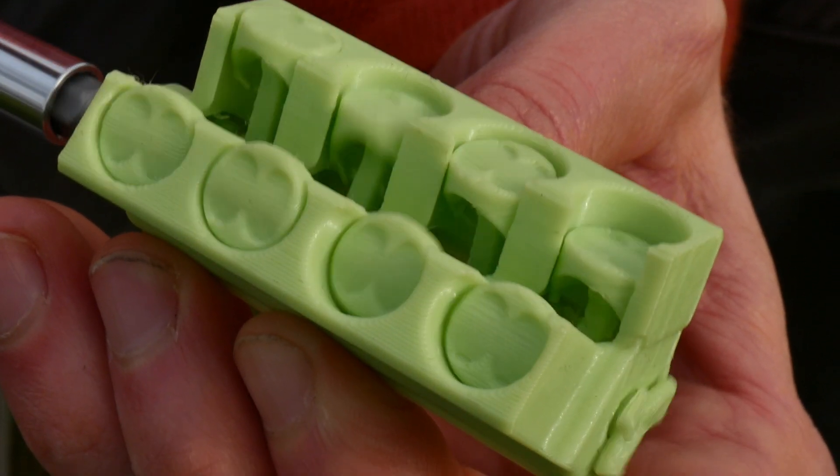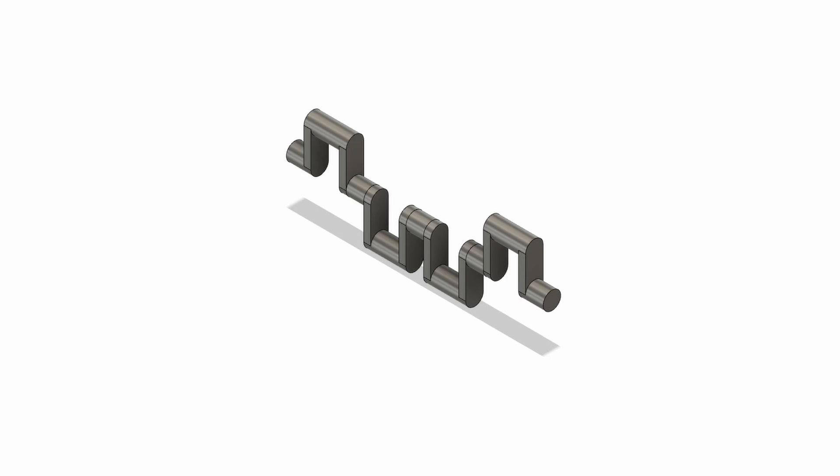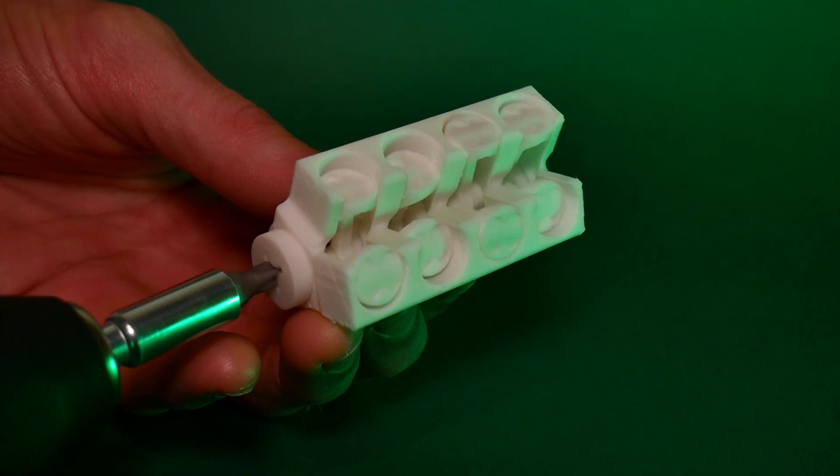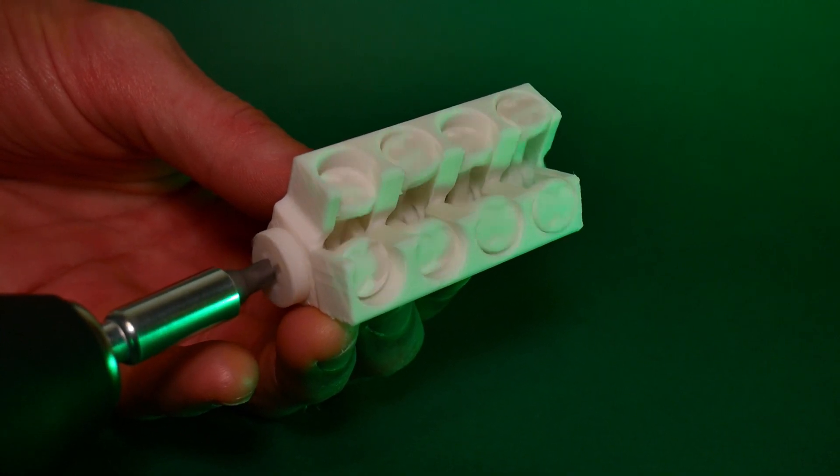This is the opposite of a flat-plane crankshaft, where the crank pins are, you guessed it, in a single flat plane. V8 flat-plane crankshafts are usually used in racecar engines, due to crankshafts being able to be created lighter, and thereby better suited for high RPMs.